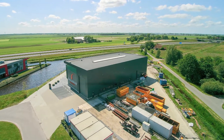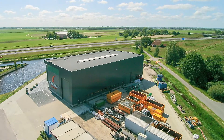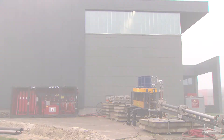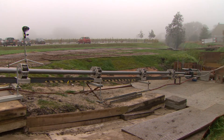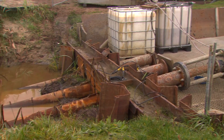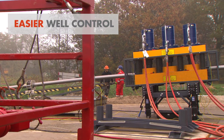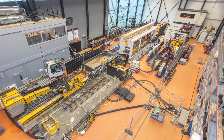The concept of SOX has already been proven by drilling a number of test wells in the north of the Netherlands. In this case, the pipe forming line and drill rig are located inside the building. Once it has been formed in the pipe mill, pipe is guided out of the building and into a conductor pipe. The conductor pipes are set up with an inclination of 80 degrees from vertical. In this prototype machine, the equipment for secondary well control is mainly situated in the outside area between the building and the conductor.